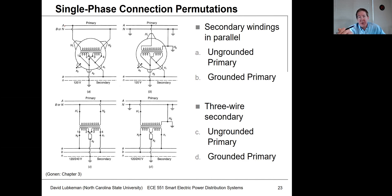Some circuits are ungrounded, so in that case you'd have two high-voltage bushings for a line-to-line connection. If you don't need 240 volts, you can parallel the connections on the secondary of the dual-voltage transformer. This doubles the current-handling capability — you only have 120 volts, but you can handle more load current by putting those sets of windings in parallel. This example shows a line-to-line connection on the left and a standard four-wire line-to-neutral connection on the right.